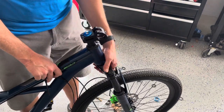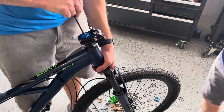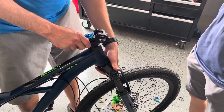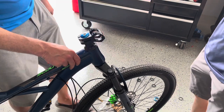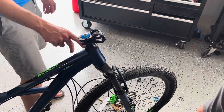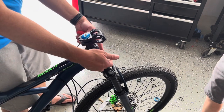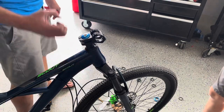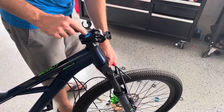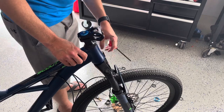There's still some slop in that. Maybe tighten it. There shouldn't be any slop in that. The problem with these is they just use a bunch of little spacers, some crappy bearings, and so there's just a lot of play in here — and there shouldn't be any play. It should be solid. See how it's like bouncing? This top cap is tightened down but it's still bouncing around — like the bearings aren't seated properly or something.